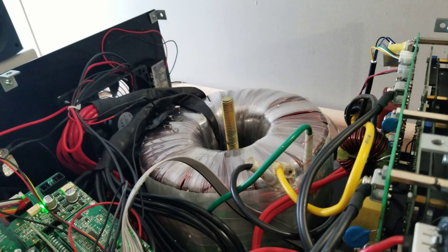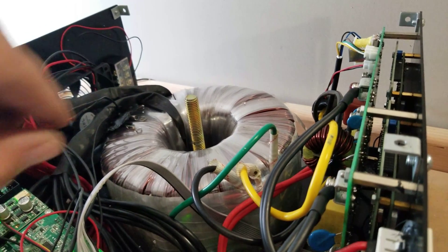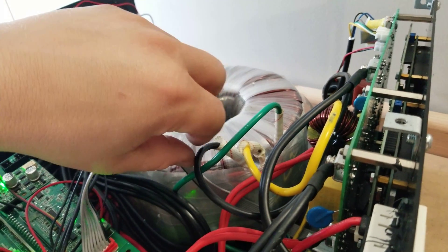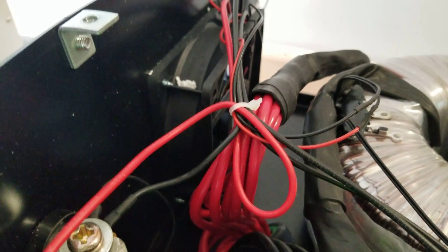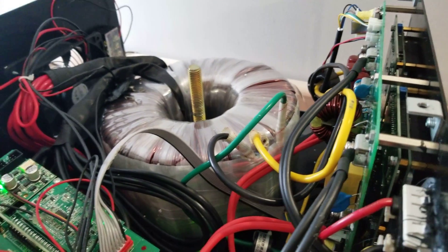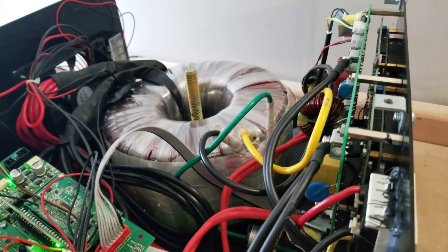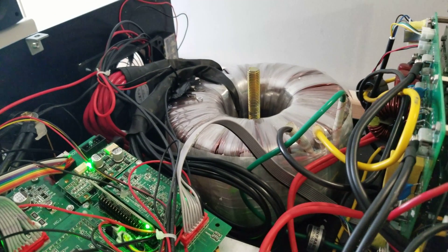You'll also notice that they are using thicker wire now. This is a suggestion I had about a year ago — I suggested they start using thicker wire because you're talking about an enormous amount of amperage. This is 10 gauge and there's 12 gauge back here, so they did beef it up because there's a lot of electricity — 10 kilowatts — going through these three wires.